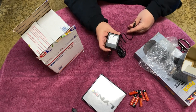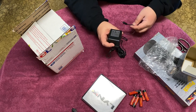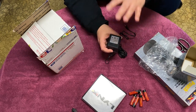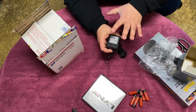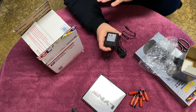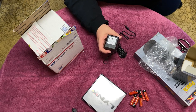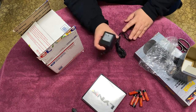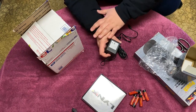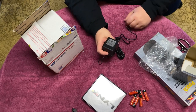and that's why I'm not taking the chance trying this adapter out today. I'd rather get it done when I get it rebuilt, because even though this Atari is supposed to be in working order, it's always a good idea. Always, if you haven't gotten it done yet, get your Lynx recapped, get the MOSFET replaced, get your power circuit rebuilt. Because they will fail. The power circuits in these are, no matter if it's Lynx 1 or Lynx 2, they're ticking time bombs. So you have to replace that.